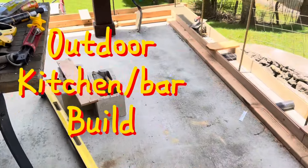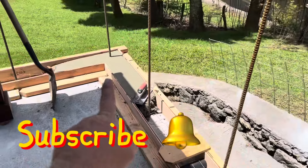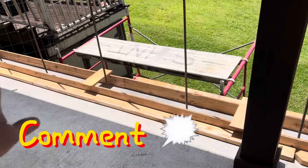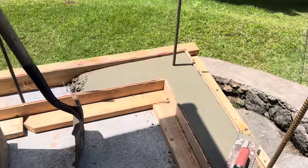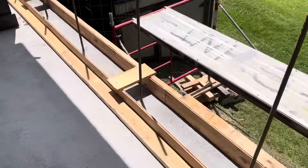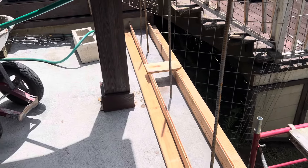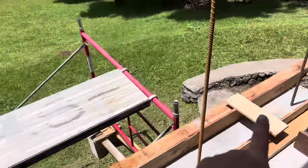Got this laid out already — it was off about four and a half inches. We're gonna put this footer in level going this way, and then we can lay the block going up. Just lay this little footer, put a little bit of wire, and run it this way.